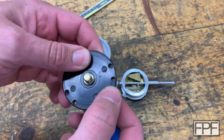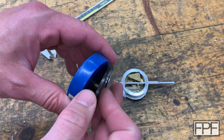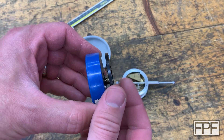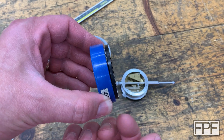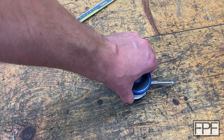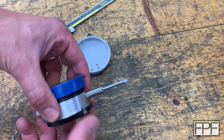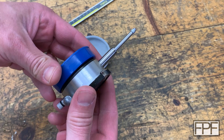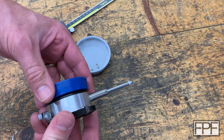What I broke here is this piece is cracked, because this isn't straight — it's never been straight, at least not since I owned it. If I thread this on here and you watch — see it wobble? When you try and use this, the indicator would normally be mounted to the back of this, so you put it on a lathe bed or milling machine wherever you're trying to measure. The problem is it ends up at a funky angle, so you'd have a parallax error.